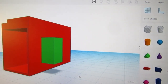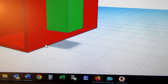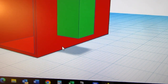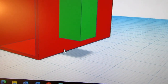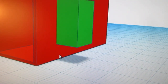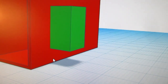One more little refinement. Right down in this area, I'm getting really close to a surface mount transistor, and the original cardboard holder does ride up on top of that. I hadn't noticed that when I took the measurements, but because this version is a lot more rigid than the cardboard, which just gets an imprint put into it by the transistor, on here, it actually needs to have a cutout.